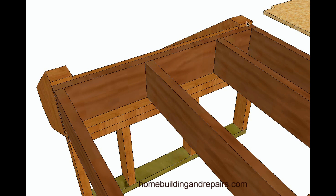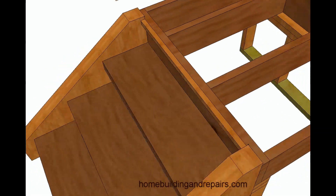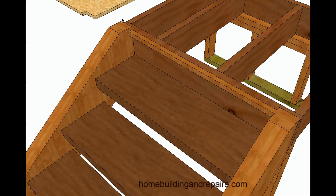There's going to be more information in the book about this. You can do this a variety of different ways — you can finish it off here, have it go higher, go straight up, or go lower. It's not really a big concern as long as the hand railing is going to work. I like to have everything look nice, and it looks nice when the tops of the stringers are flush with the landing.